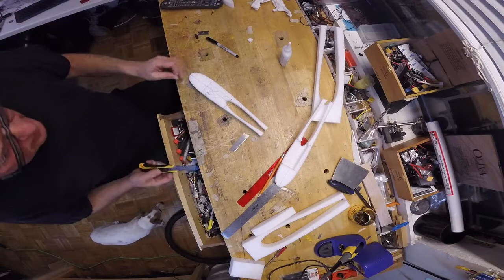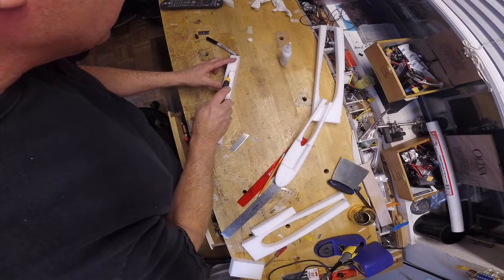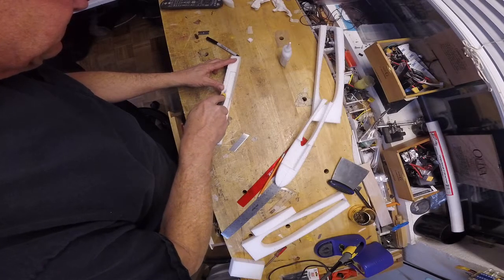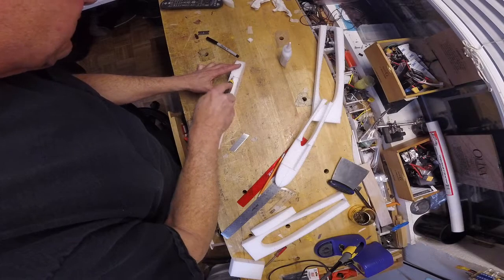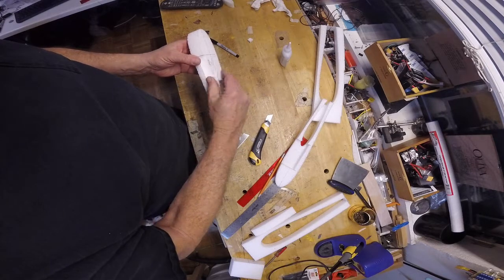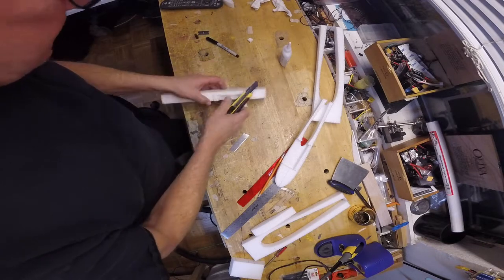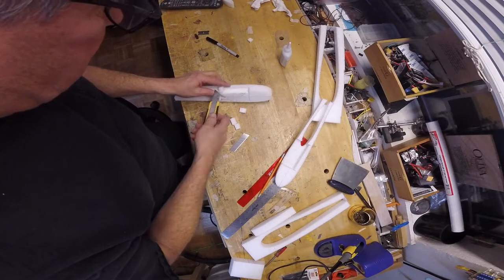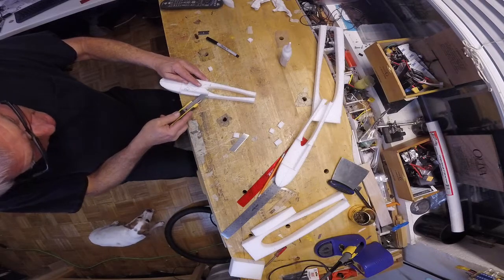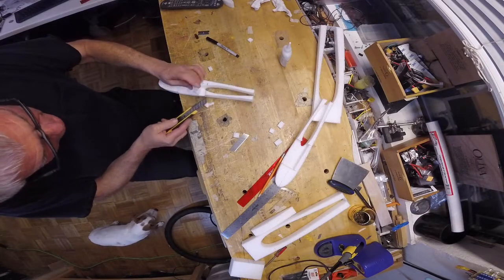Okay. Now that we've got all those cuts 5/8 of an inch, we can go to the top, and set our blade and the depth. Make sure we're going perpendicular, 90 degrees down in there. Make this cut out. This will allow us to take these first ones out here. And then all we simply have to do is we can kind of start using this as a guide. Keep our blade flat. Cut the next ones out. They'll pop out really easily.